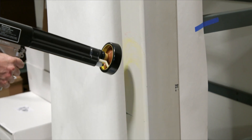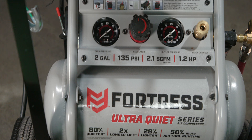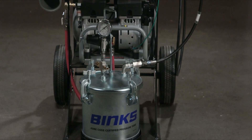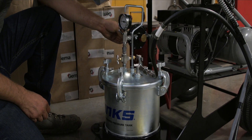That's because there is no overspray cloud for the most part. The color just seems to start appearing on the surface you're painting. So if the system doesn't use air to atomize the paint, why the air compressor? The air compressor is used to pressurize the ASME-rated 2.8 gallon tank, which delivers the fluid to the spray gun through a fluid hose. The tank is equipped with an extra sensitive regulator, which is used to carefully tune the flow of paint.